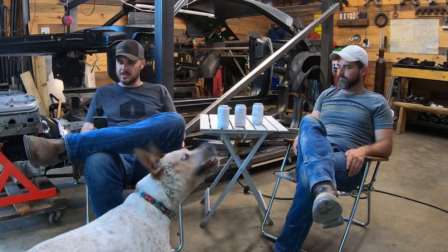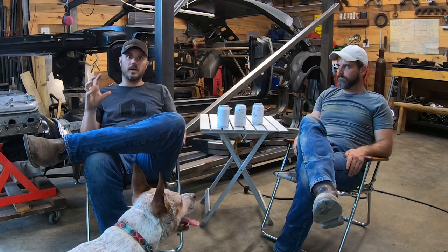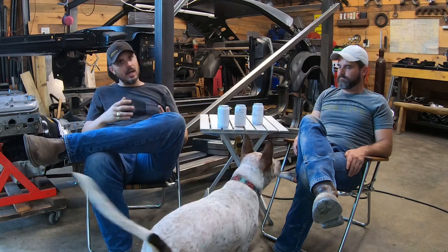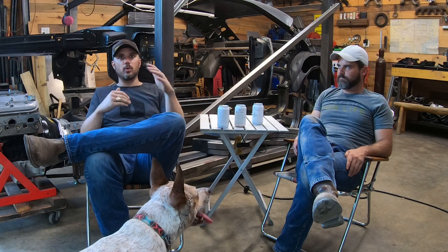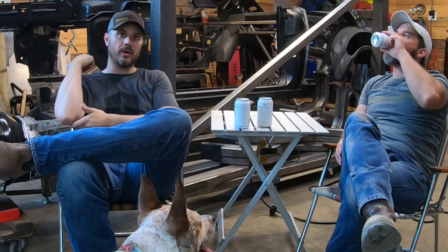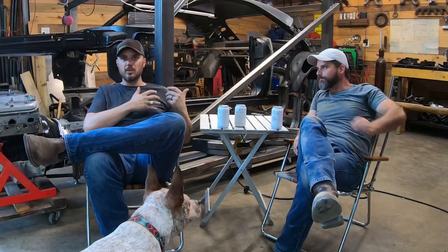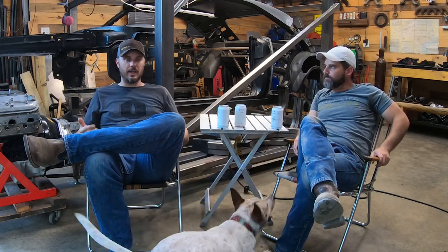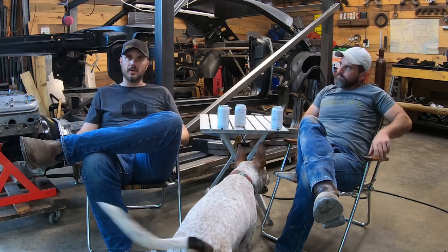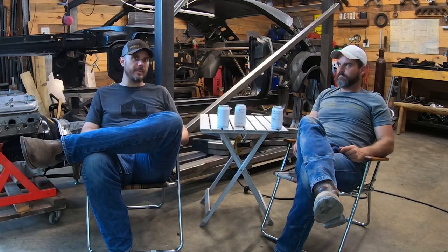So 100, 110 amps. And then my gas flow rate, I'm using a number 12 Furick FUPA cup, ceramic doesn't matter, but the number 12 cup with a gas lens takes a lot of argon, and it's on an open corner. Depending on what I use that cup for, I'm between 30 and 35 cubic feet per hour on that particular one, and in my opinion, argon's pretty cheap when you think about how long it'll last you, and you get great coverage and good coloration as you're going through. That's what I'm using. Smaller cups would use less, like a number 8 cup, probably 20 cubic feet per hour.